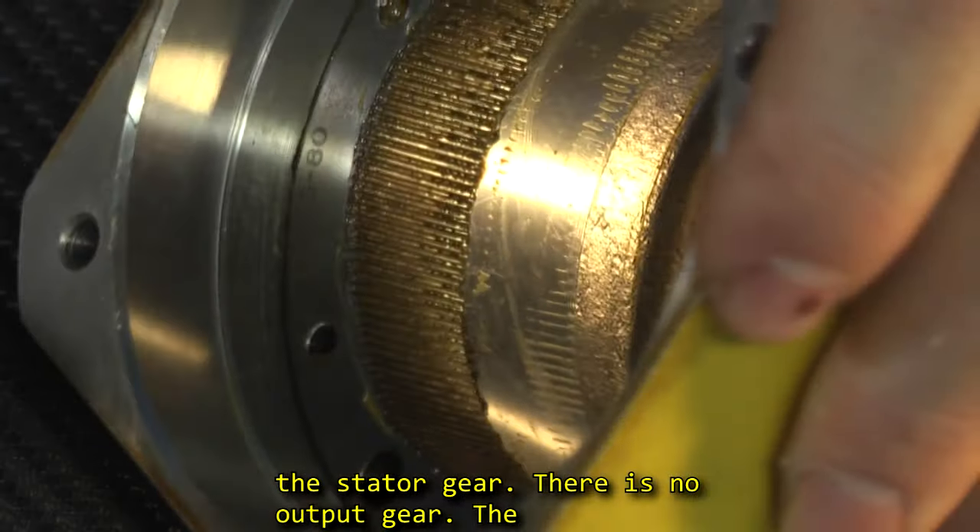While very difficult, you can make strain wave gear drives at home. For those in industry, they're actually a really impressive mechanism and there's really no maintenance involved — they're either completely broken or completely working. They do wear out over time and can build up some backlash. However, most factories replace their robots every couple of years, sometimes as often as every year, just because the wear and tear causes them to become more and more inaccurate over time. Accuracy on an assembly line is of paramount importance, so you'll see most factories opt for a preventative maintenance attitude and simply replace the entire robot assembly line.